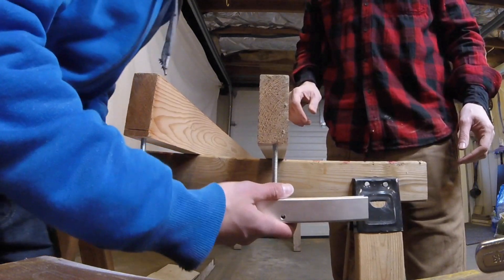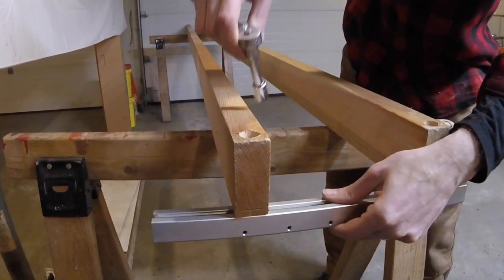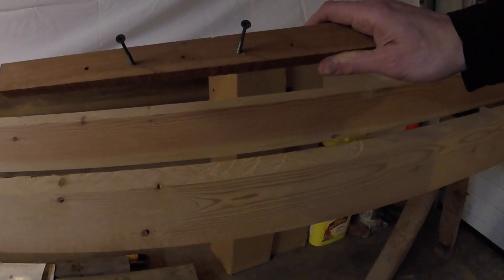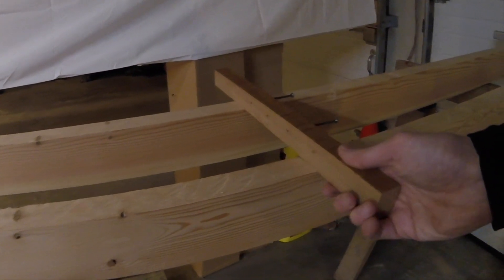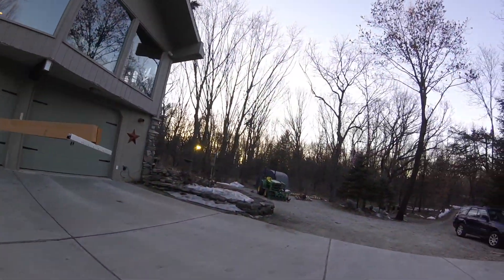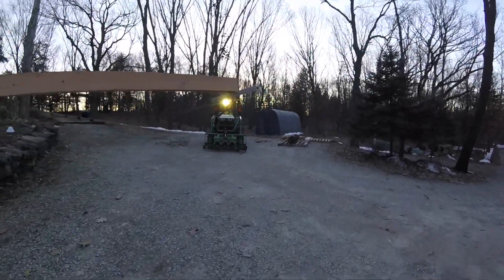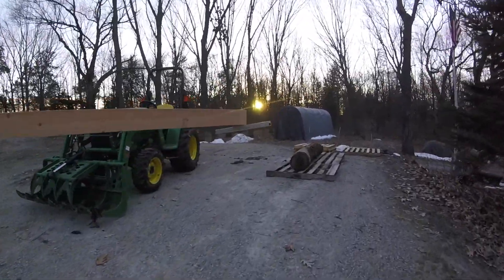We then attach the brackets to the rails. I will leave a link for these brackets and also Granberg's website in the description below. Since all our logs are cut to different lengths, I found this piece of sacrificial cherry wood to use as another attachment point along the rails. There are a number of different ways to make your first cut when slabbing lumber, but we felt that the adjustability of these brackets would be more beneficial as we would be working with a variety of different diameter logs.